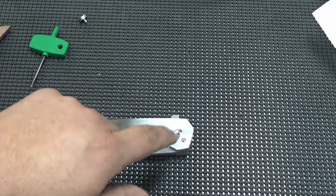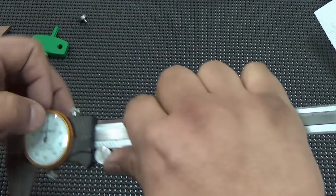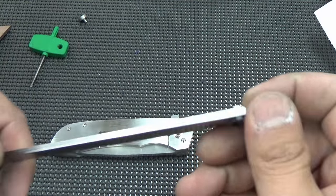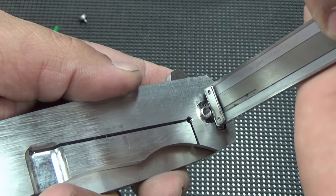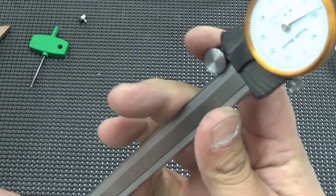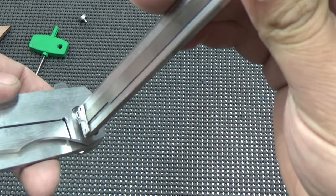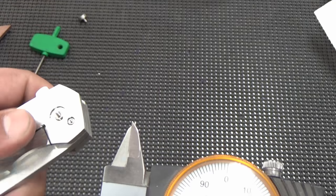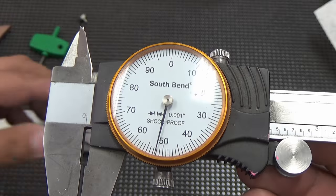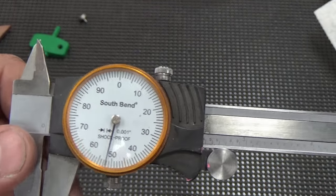How are we going to measure how much to take off the pivot? If you have a milling machine, we all pretty much have one of these, and if you look on the bottom it's got this little protrusion that you can measure depth with. With a 3/8 pivot head you can just get it in there and measure how much you're sticking out on that pivot. According to this we're 52 thou, so you want to sink it a little below the handles — but not so much. Let's go 68 — we'll trim 68 thou off the pivot.